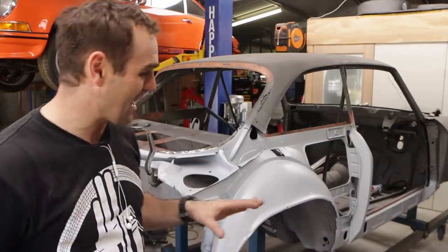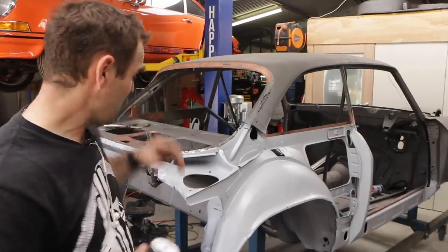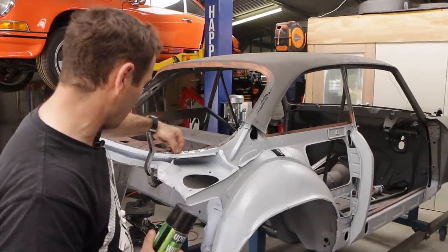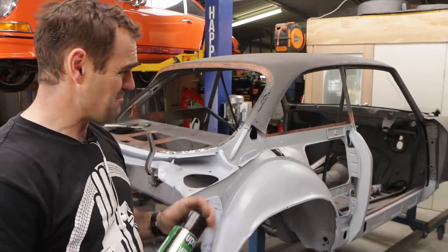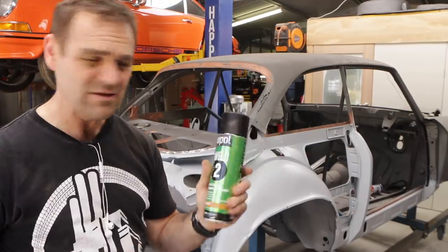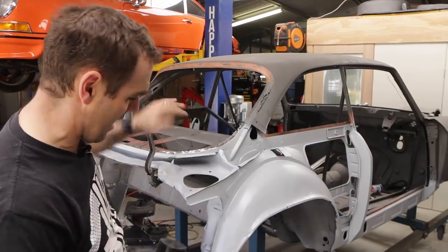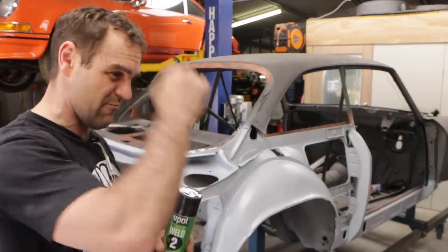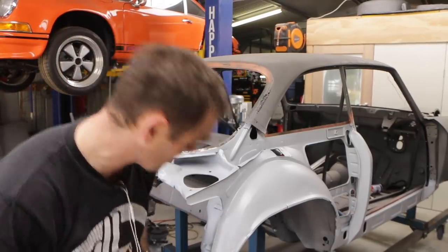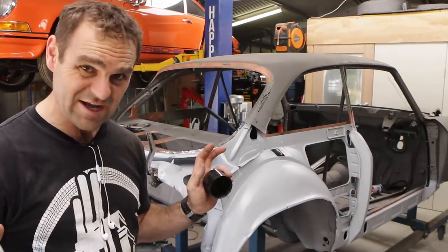Okay, so the last step in preparing the underside of this car for the panels to be welded on is to go around and just use some weld through primer on some of the bits that I've left exposed where I'm going to be welding. Some of you asked about this, I'm just using a U-Pol copper rich weld through primer. I'll put a link in the description if I can find something. Basically that will be the level of protection I need around the bits that are going to be welded together, but everything else is nice and primed up solid. So let's do some primer and then we're pretty much ready to go.